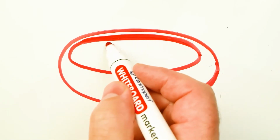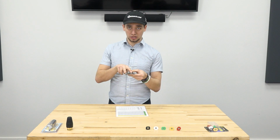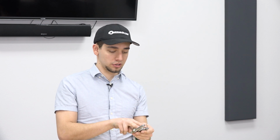It's for drawing soap. If you use an assassin nozzle without drawing soap, you're not going to get the same results in the distance. We have 2 0 degree tips on this J-Rod that we use for our 7 to 8 gallon a minute machines, a 060 and a 020. Then we have 2 25 degree tips, a 2560 and a 2520.